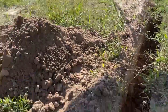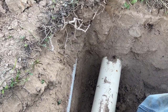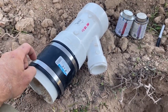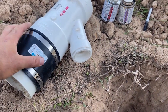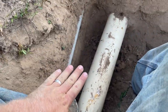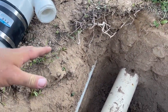We've gotten in here now to the main sewer line. I'm sure some plumber's going to tell me I'm a hack and this is against code, but it fits the code out here on my farm just fine. We're going to cut out between these two black marks and drop in this assembly — a PVC nipple and a sanitary Y fitting. I've got to have enough room to drop it in, slide it over to glue that fitting, and then slide this coupling back to join it. You've got to give yourself a little wiggle room to get in there.